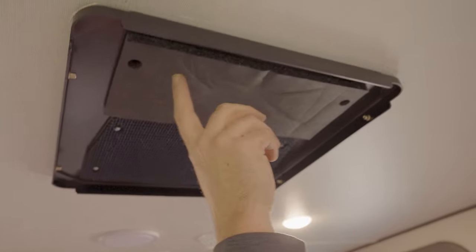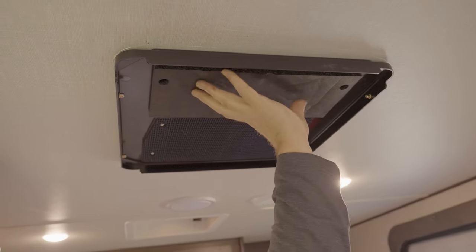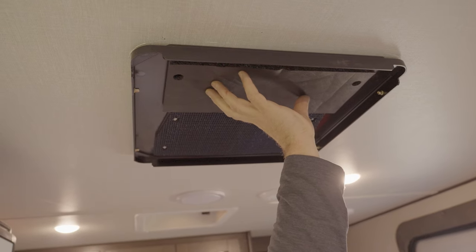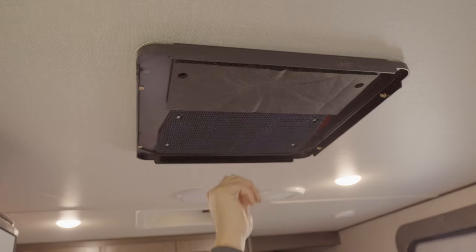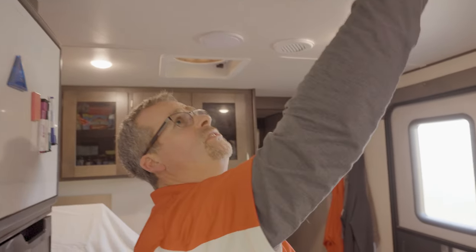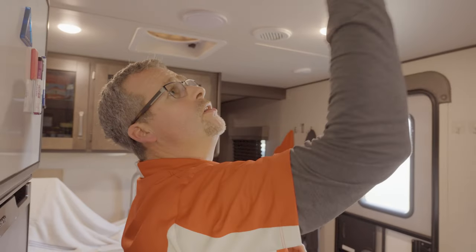By the way, I was talking about that gasket that was behind here. As you can see, this is blocking that, if you want to call it, cold air dump off. That's where you had the option to open and close that vent. That's where we want to make sure that seal there is in good shape, so that when this goes up tight, we have no air leaks. Again, where there's air leaks, there's noise leaks, okay?